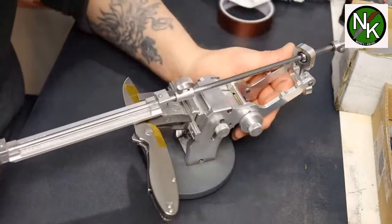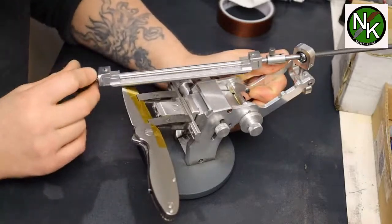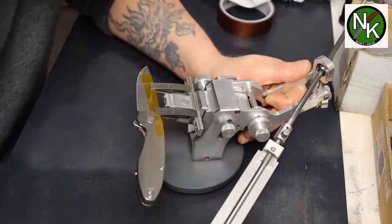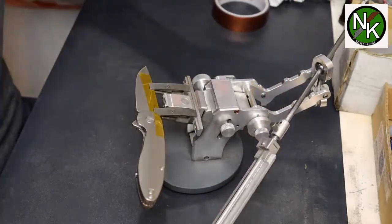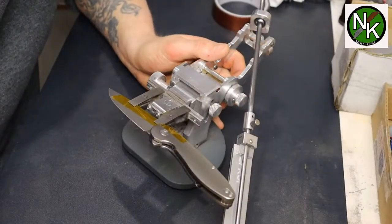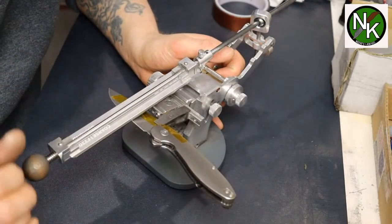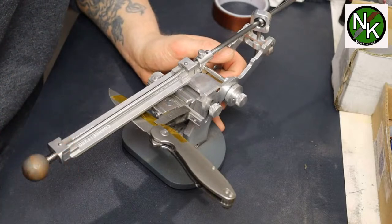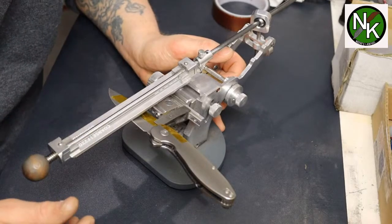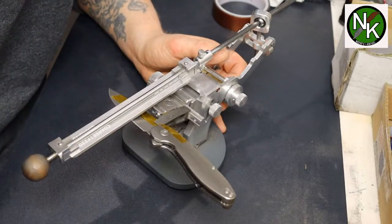All right, we are basically done, but I'm going to do a burr removal, then strop. I want to tell you guys though, if I wanted to put a polish and I wanted to do it from diamonds, this wouldn't be my finishing stone. I would go all the way up to my 1,000 grit of these plates, and then I would strop, because then coming off the strop it would give me a polished finish.